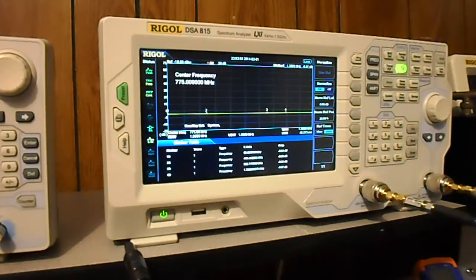Now I'll go ahead and attach the preamp — it's a very small unit. At the low end it has something like plus 24 dB of gain. Imagine a couple of these in series on the front end of a receiver. You'd have to protect it, but for weak signal work — wow. You could use it in conjunction with PIN diodes or relays to switch it in and out of the circuit at the antenna for moon bounce.